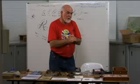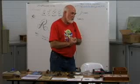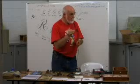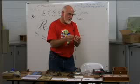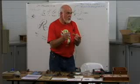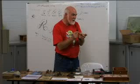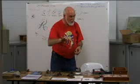The only thing that varies now is that we might have more electronica. We use a lot of dental technology now. I have the most beautiful little motors in hand pieces which are completely vibration free. A lot of the engraving now is done with the high-speed steel tool, but the handle encloses a little air ram, which is fed by a little plastic tubing with compressed air. And this little ram is hammering away in there at something like 30,000 strokes a minute. So it's just like a little high-pitched whine, and all you have to do is hold the tool on the metal and just push it through the metal.